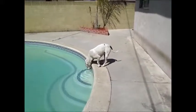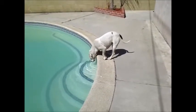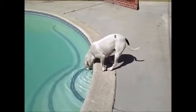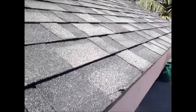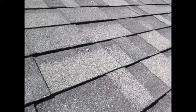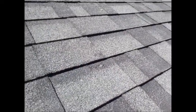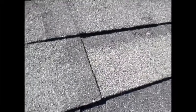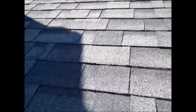So I'm about ready to get on the roof. This is a composition shingle roof, probably about eight years old. The ridge cap doesn't look like it's deteriorated yet, but you can see some deterioration of the shingles along the edges and on the field, so it could be a little older. Once I get on top I'll have a better understanding of the age.